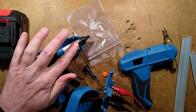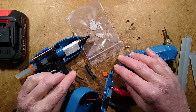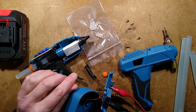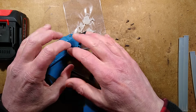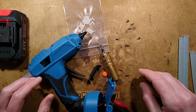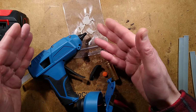So that is a PTC, self-regulating heater in there. The current is down at 2.4 amps. How exciting, it's watching this heat up. 2.2 amps. I will tell you what, I'll pause and I'll tell you what it stabilizes at. That's more or less stable. I put the cover on for an accurate representation since it's not dissipating heat into the air. And it is roughly 600 milliamps at 20 volts, about 10 watts standby, just sitting there.